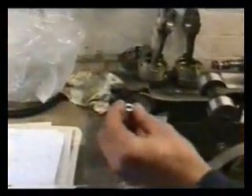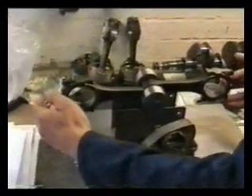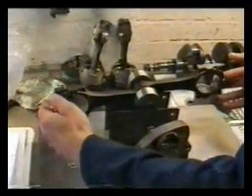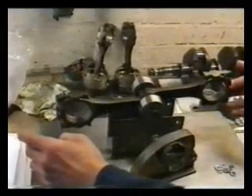So I know how much metal to take off, I've got some washers. I just put those on — this gives me an indication of how much metal I've got to remove. Try it with a couple. Pretty much balanced there, probably needs three. Nearly balanced.